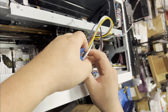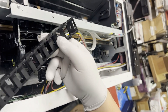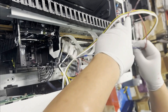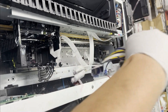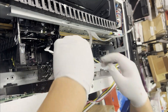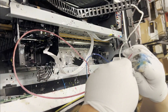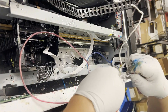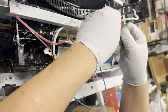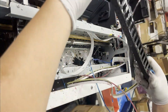Look at all the things the customer used trying to keep those tubes together. We decide which side is up and which side is down. We disconnect all the dampers so the tubes can go through the drag chain. On the left side, we push a rope through the drag chain, then put all the tubes together and use a cable tie to tie all the tubes to the rope. Then we pull the rope and all the tubes go through the drag chain.